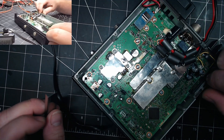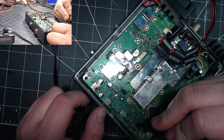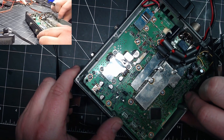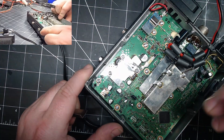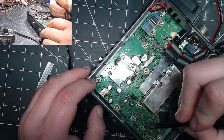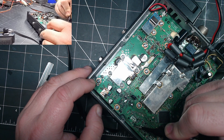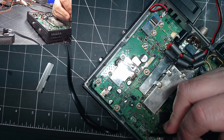We've got a bodge wire over here. They did a nice job with the bodge. I can see there's some traces of that. There should be a shield over this — that's what that tab is. I'll bet you when they pulled the shield they broke some of these traces.